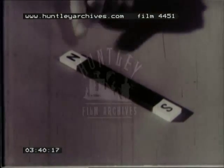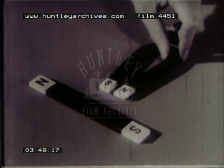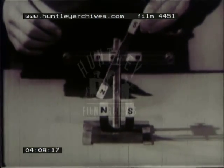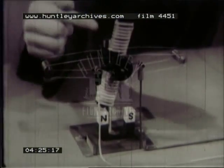Let's go back for a moment to permanent magnets again. They don't have to be bent into the shape of a horseshoe — they can be just straight bars like this. At one end of the bar is the north pole of the magnet, at the other end is the south pole. A horseshoe magnet also has north and south poles bent round to bring them side by side. Now if we pivot a bar magnet on an axle through its middle and put a horseshoe magnet underneath it, the north pole of the bar magnet is attracted towards the south pole of the horseshoe but is repelled by its north pole. The opposite happens if we turn the magnet right round — like poles repel and unlike poles attract each other. An electromagnet can be made to do the same thing. As soon as the current is switched on, one end becomes a north pole and the other a south, and it behaves just like the ordinary magnet.